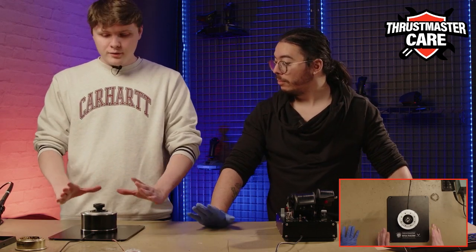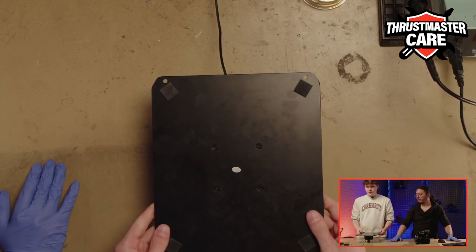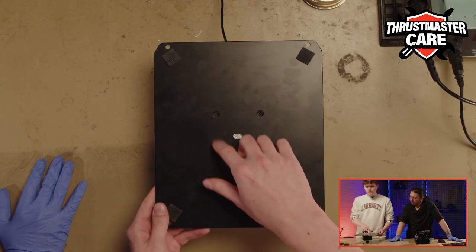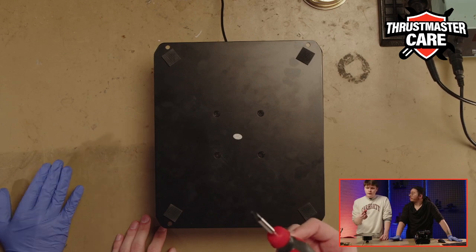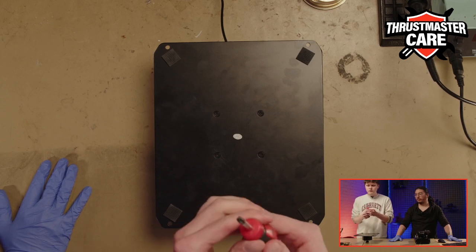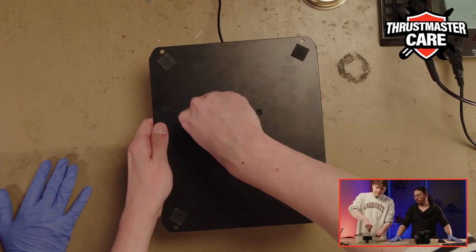First, then we remove the joystick. Now we need to turn the product, your base. I will center it. And just at first, we will unscrew these four screws. So you can take a four-edged screwdriver, a cross-edged screwdriver like this one. I think it is easy to find. So you unscrew.